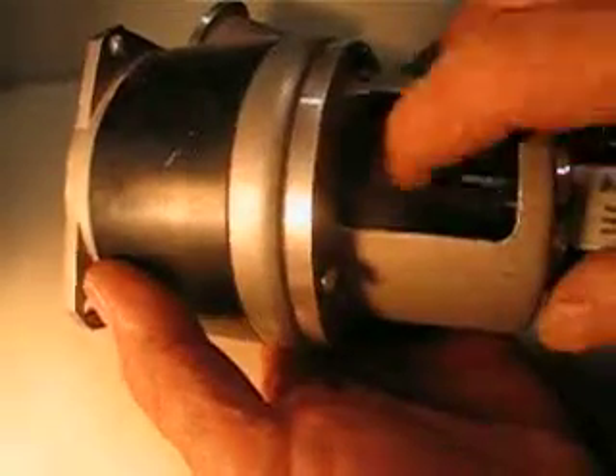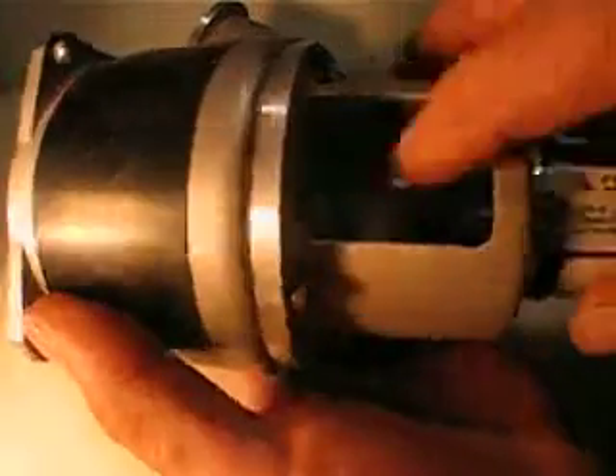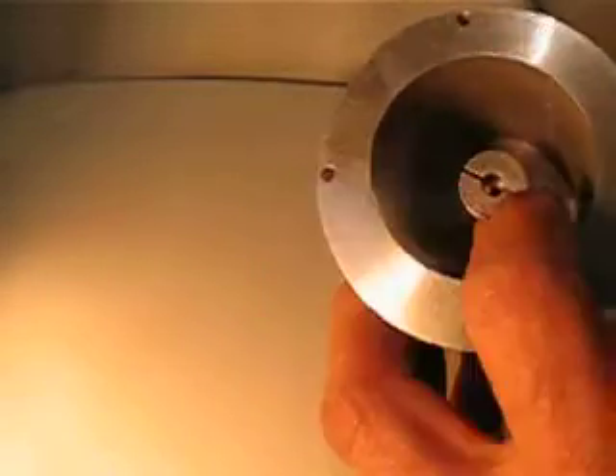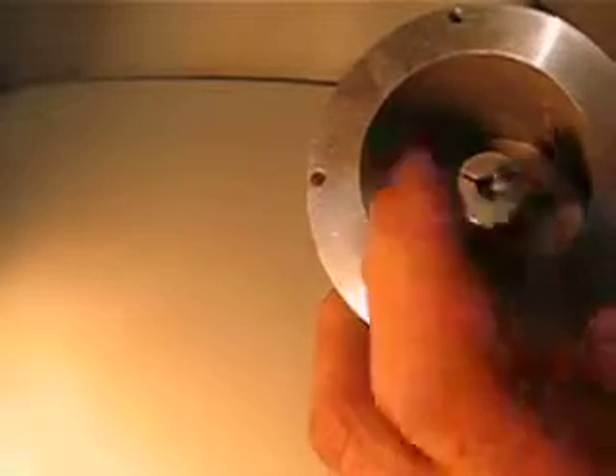This is a large motor but the shaft looks to me like 5/16 on the back — it's not a one quarter. I'm going to put this for sale later including the motor. Anyway, this encoder is one quarter inch on each side, so your motor has to have a double shaft and the back shaft has to be one quarter inch.